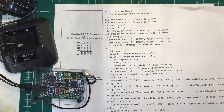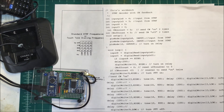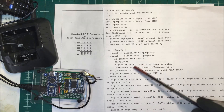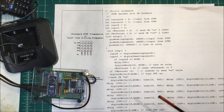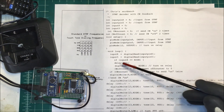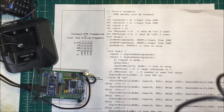The same thing is done for input pin five: I digital write pin 12 low to turn the LED off, then digital write pin nine high for push-to-talk, and send the CW code for OFF. There are probably better ways to write this code, but I kept it simple just to verify the hardware works. Eventually I'll add some kind of combination lock so you have to push several buttons to turn the LED on and off.